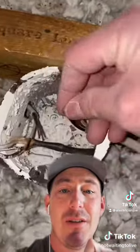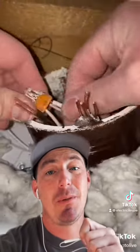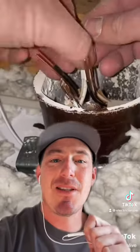Another thing you'll notice is he uses these push-in connectors. I am not a fan of those. Those are not WAGOs — contrary to popular belief, those are just regular push-ins. I do not recommend them; they have a lot of issues. I would recommend either wire nuts or WAGOs, whichever you can manage. The tape is not necessary — as long as all the wires are inside the connector, it's not necessary at all to tape it.